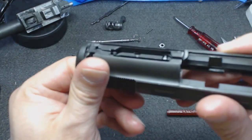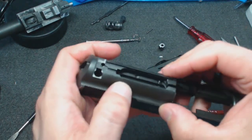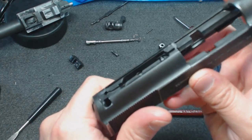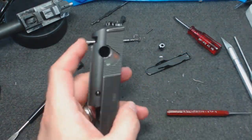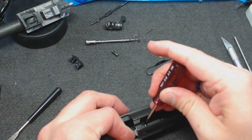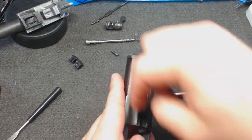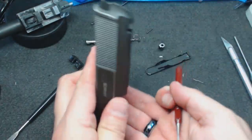This is just drilled in at an angle. While you can see the back of that spring, you really don't want to try and take it out from there — you'd bend the living crap out of it. So the back of this is the front of the extractor, and this pin here is the back of the extractor. It's blocked by the plunger, so we need to get something in there to push the plunger out of the way. I was just able to work it out with my thumb — I was thinking I was going to have to poke at it, but it came right out. Now at that point, maybe that visible hole is there to help you tap it out.